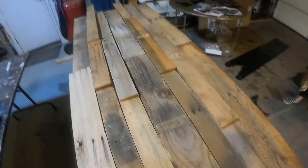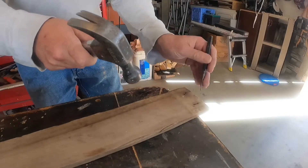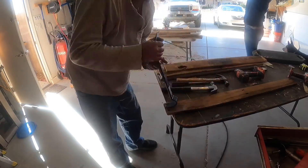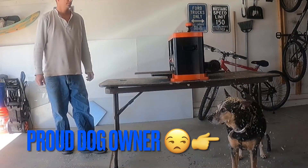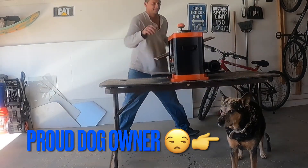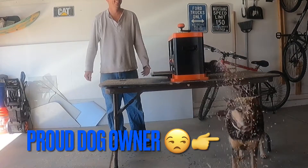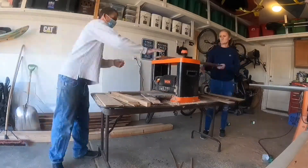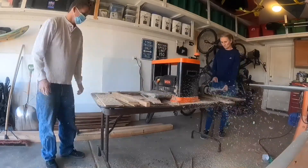I laid my pallet material out on a table to get an idea of what it was going to look like. Since I was going to run this stuff through a planer, I had to make sure all the nails were removed out of the pallet material — using a screwdriver, a pry bar, a punch, and a hammer. I had bought this WEN planer specifically for this project and had really good luck with it. I started with a couple pieces and then ran multiple pieces through at the same height. With pallet material, running it through one side and then flipping it over at the same height would cut off a little more material depending on the warpage.